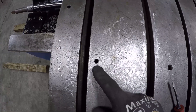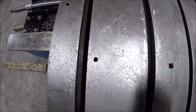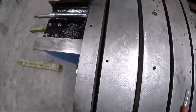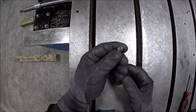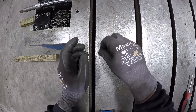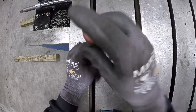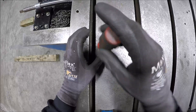These are the oil ports I was talking about - you can see it says 'oil' right there. Same thing over there, and then of course you got two more over there. The good thing is they weren't too clogged. You just take out these slotted set screws and squirt a little bit of oil in there and you're good to go. A lot of manual oiling on this thing.